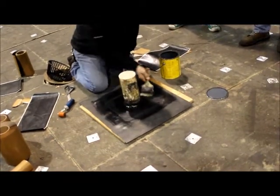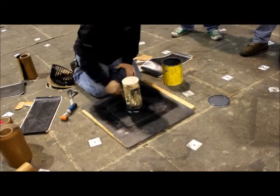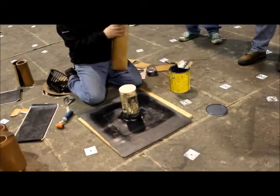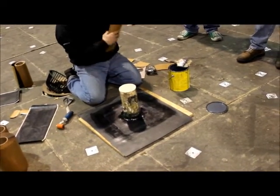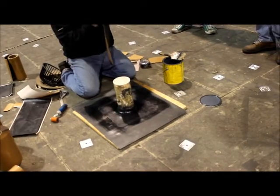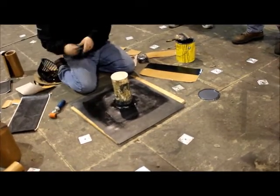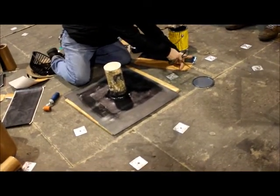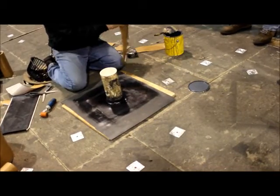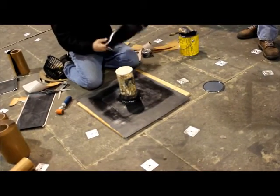You want to get about two inches on that flat for Firestone. You get an inch and a half — they're not going to say anything about it. Just give that a second to dry. Pull all the paper off. We can show you this too — if you want, you could just score this and make this two inches. Then this paper will stay on for you, like that. This way it's set for the bottom already.